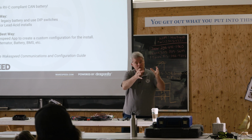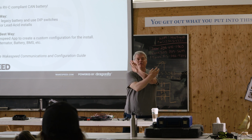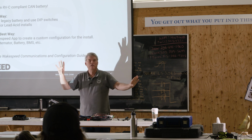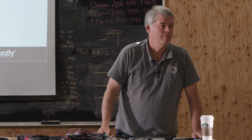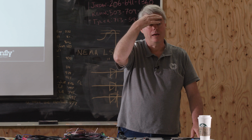Unlike if we sent a binary representation of a number, this guy may treat that binary number in what's called little endian, and this guy may treat it in big endian. You have to know how each guy treats it, and what the binary format is. It's complicated. Using ASCII is just a universal way to do it. That is why the Wakespeed regulator uses ASCII to communicate.